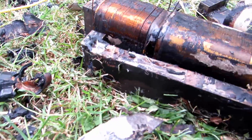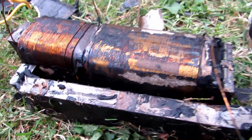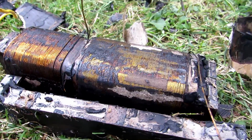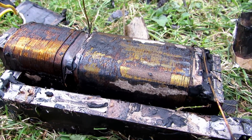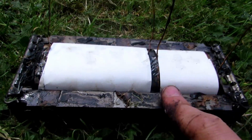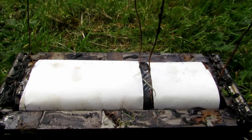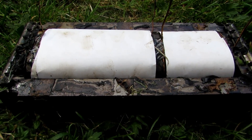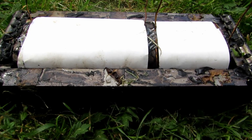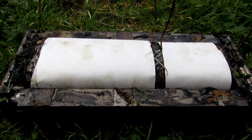To put it back together, it's pretty simple. We grab our two chunks of iron and put them back on, then tap the end caps back on with a hammer. I also put some paper down to help insulate it from the thick iron core, and a bit of hot glue just to hold the leads in place. That's basically how to rewire your transformer. I just left this the same because I'm going to use this as the primary and this as the secondary to step down the voltage for my hydrogen generator.